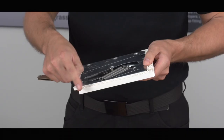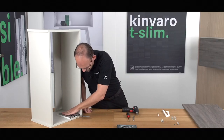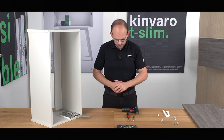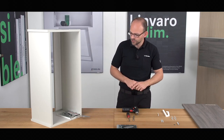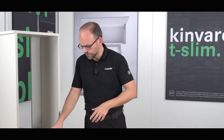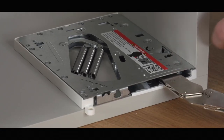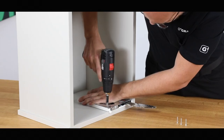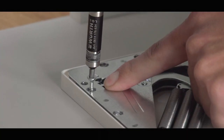Now I can insert the fitting into the cabinet, push it against the top shelf and move it backwards. I have an automatic stop point here, which can be broken off later with a screwdriver or tool. Let's take a look at assembly with the screws — we need four screws. I'll now show you the mark where the screws are inserted. These are included in the set with the adapter bracket. We can now screw the fitting on firmly. We have to check that the whole thing is in contact with the top panel and pay attention to the mark on the front stop. The position for the screws are marked in each case to ensure they're fitted correctly.